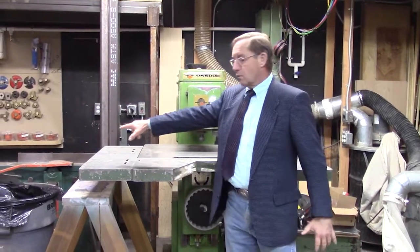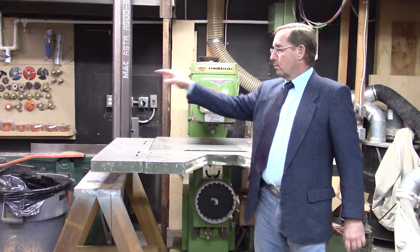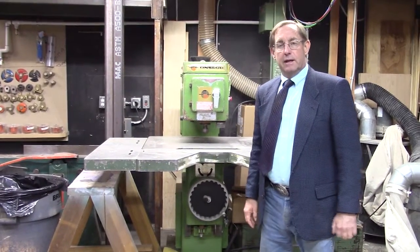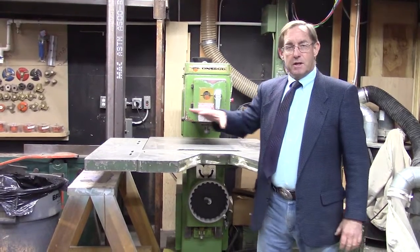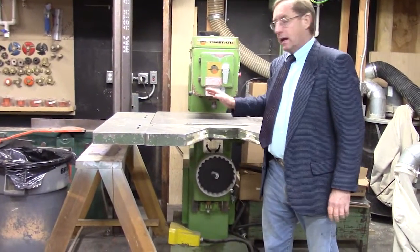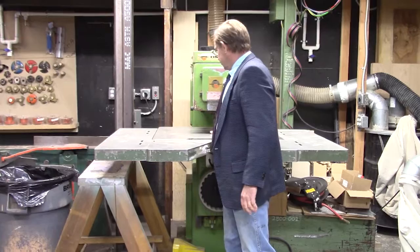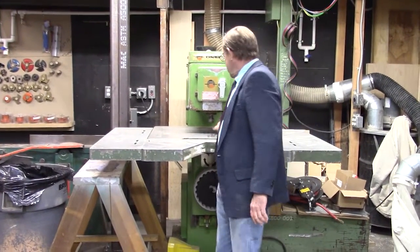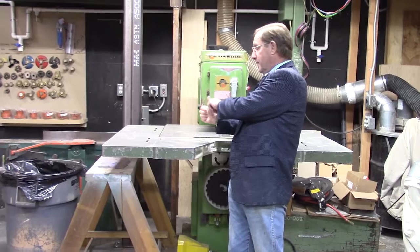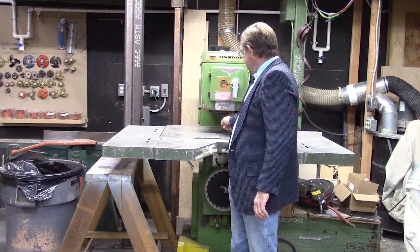We're going to make a removable tabletop that's about 6 feet out this way, and it'll go both directions, 8 feet. So obviously it has to be one that you'll put up and pull down, otherwise it'll take up way too much space in this little shop that we have here. So we're going to make that, and it'll just hang on the wall here, and as we need to use the machine, we'll take it down, set it on top, and it'll have a hole here in the center for the pin to pop up. So the pin pops up from the bottom like this, and that jig will ride around against that pin. And from the top down is the router.